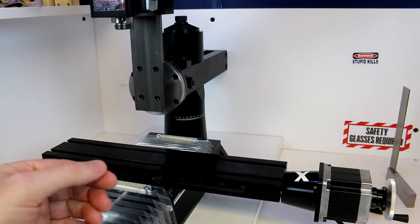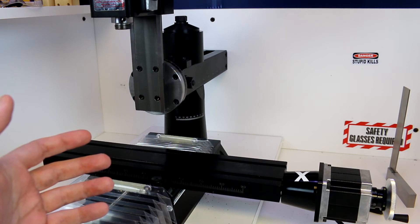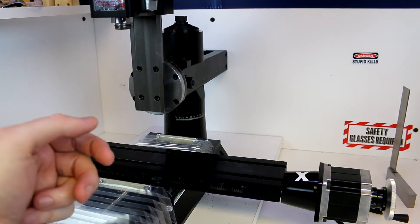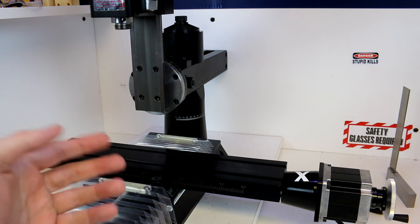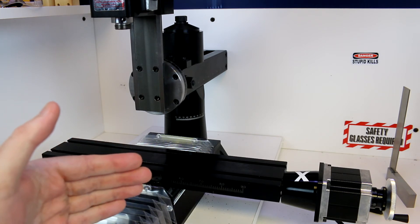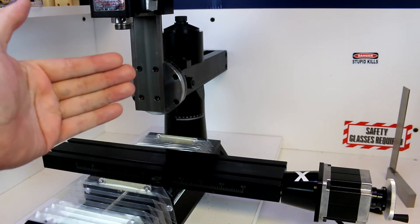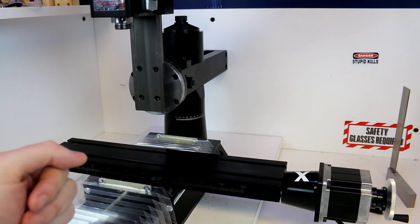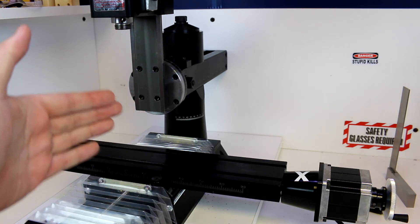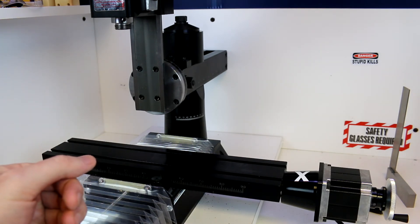As I was making this video, I decided to break it up into multiple parts. In this first part, I'm just showing rough alignment — that's visual alignment and alignment using a square, not using a dial indicator. These are steps you really should only have to do once with a new machine, and after that the alignments you'll be doing are with the dial indicator, which we'll show in another part. If you do frequently make cuts where you're tilting the head and moving these axes, you will have to redo this rough visual alignment before getting back to the dial indicator stage. But for the most part, all you'll need to do are the steps in the next videos regarding use of a dial indicator.